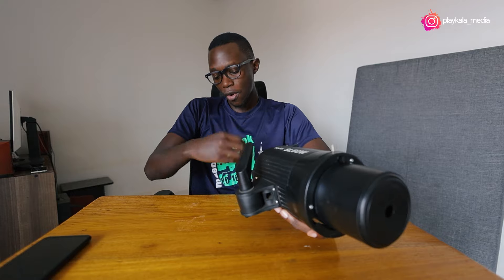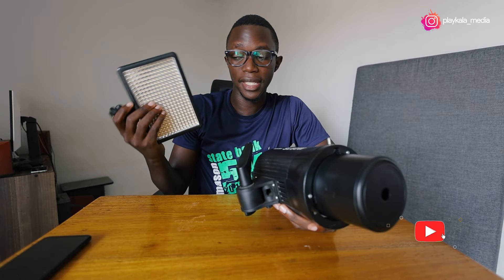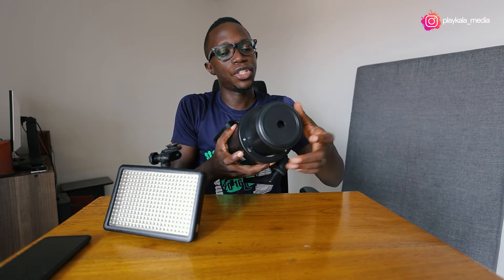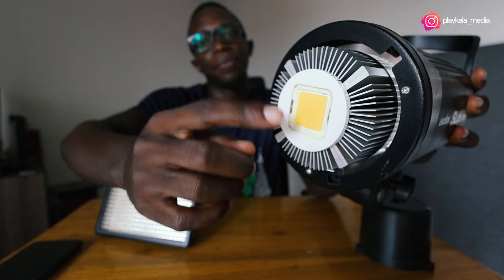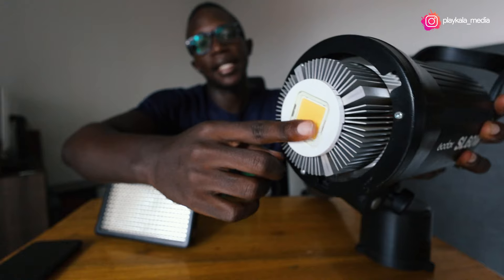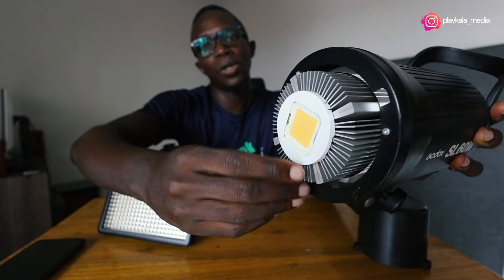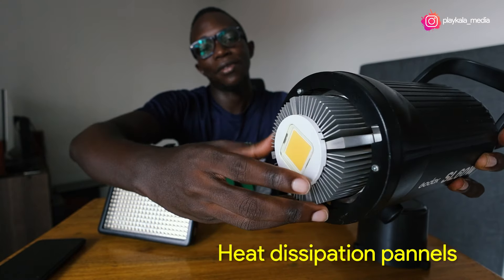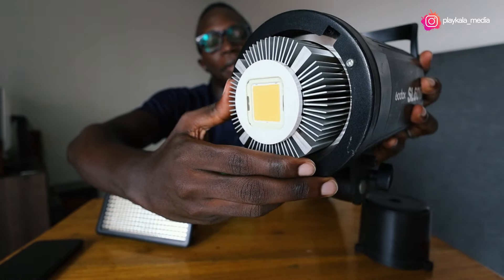This is interesting. When you compare this light with this — this is an LED light — these are the traditional LED lights that we've been using for a long time. This one here uses what's called a chip on board. If I just open it here for you guys, you can see. This chip is what casts the light. These help to keep it a bit cool — they really help to keep it cool.